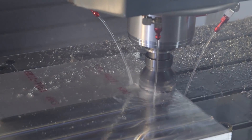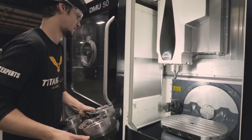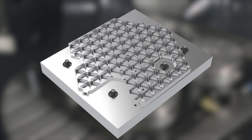Right now we're doing a pre-op for the first operation. This pre-op is going to make the material flat and parallel, and it's going to put some tooling holes. We will then take the material and go to op B, which is on the DMU-50, the DMG Mori machine. We're going to flip it over on a fixture plate and finish it complete, teaching you the whole process through different chapters.